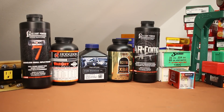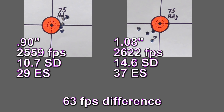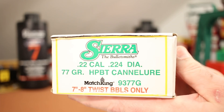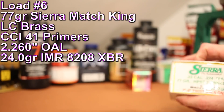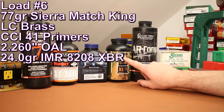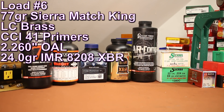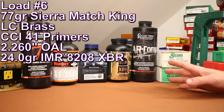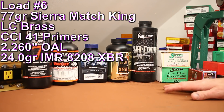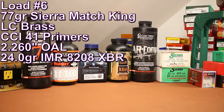The 18-inch barrel shot a 0.90-inch group and the 20 shot a 1.08-inch group — not the worst thing. Velocity difference between the two was 63 feet per second. Overall not a lot to be disappointed with. The last bullet is the subject of our Mark 262 cloning videos: the 77-grain Sierra MatchKing. We've shot the heck out of this bullet in the 18-inch SPR barrel. I decided to shoot IMR 8208 XBR again — 24.0 grains. This is a hot load; very hot Mark 262 cloning-type load that should give us about 2,750 feet per second out of the 18-inch barrel.